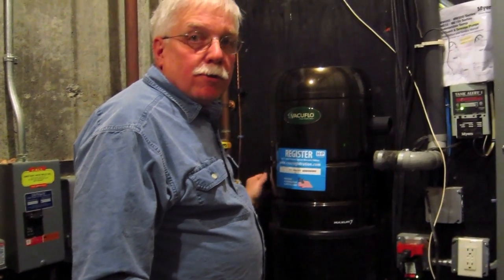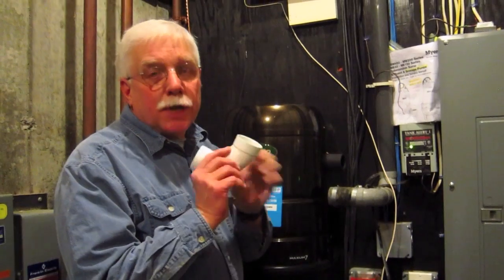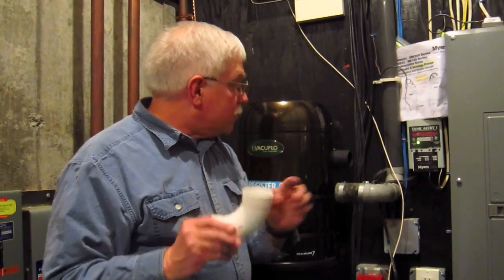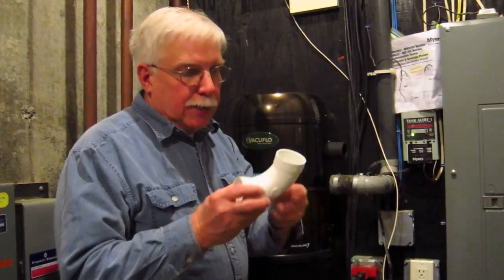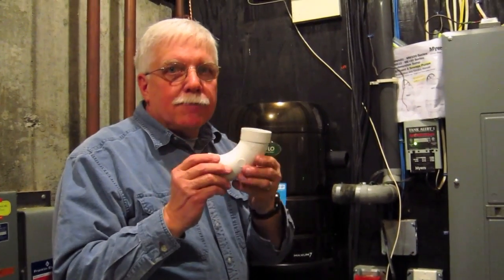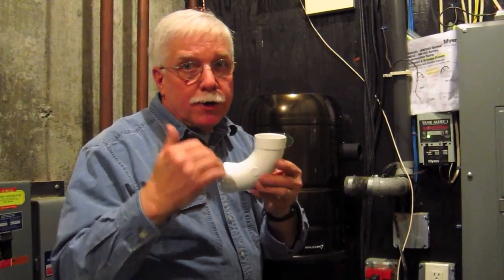There's a rubber pipe on the left side that I have to insert the other pipe into. So I'm going to use three 90-degree angles — and these are special 90s. When you install central vac systems, this is called a sweep 90, because it's a gentle, gradual 90-degree turn. They make other ones with very sharp turns, but I would not recommend those. With a sweep 90, if something almost gets lodged in the pipe, it's going to have a much easier time making it around the bend.